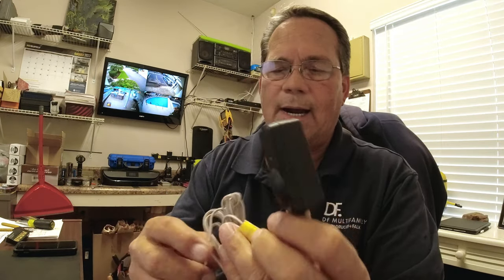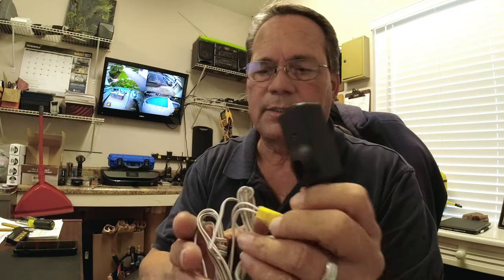Those sensors are fairly easy. As long as they stay dry and lined up and they're seeing eye to eye, you shouldn't have any issues. Now, the sensors I have are basically for LiftMaster, Chamberlain, Craftsman, which is pretty common, especially LiftMaster. So these sensors are going to look the same as the ones I put on, and chances are they'll look more like this one. You're going to get that little bit of wire that you just splice in place. Like I said, as long as your sensors are seeing eye to eye, you'll be good to go.